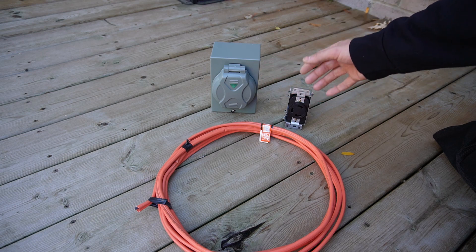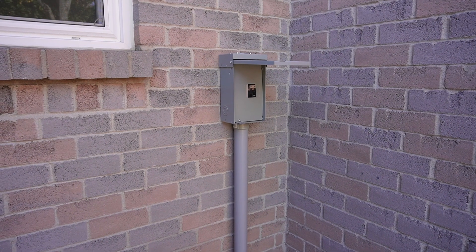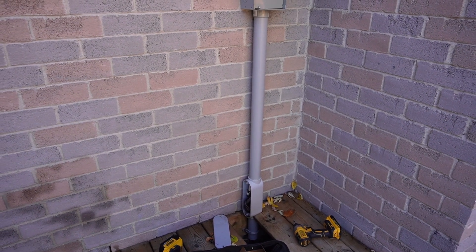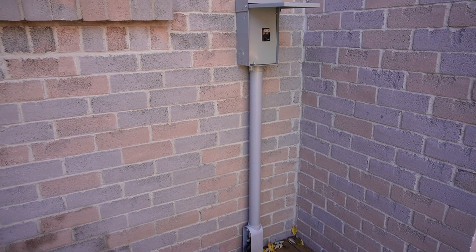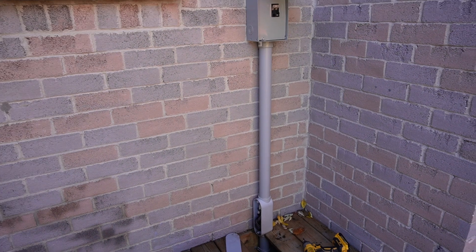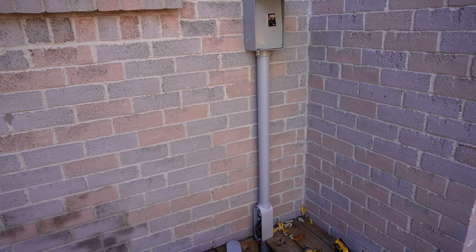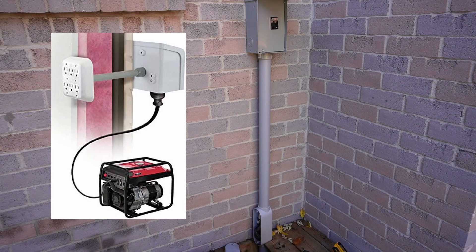So 30-amp to 30-amp, and then from there in case of an emergency I can branch off to multiple connections. Luckily with my house I have a hot tub hookup, and on the other side of this wall is the utility room where my furnaces, freezers, and all my critical loads are. I'm going to run my box up beside this one and run the wire down through the conduit into the house. If you don't have a scenario like this, you can locate the side of your house with the utilities and run your own conduit for a pretty cheap price. They do sell kits on the market — I'll leave links in the description — that give you everything you need to achieve this.